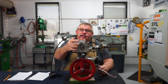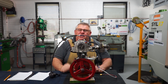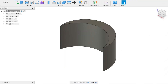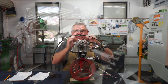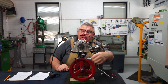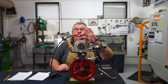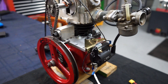The points lobe cam had me stumped. I considered welding the camshaft extension and grinding a lobe but decided that was too much effort. So I drew it in CAD and 3D printed a simple points cam lobe. I didn't want a cam lobe that snapped open instantaneously — I wanted it to gradually open the points. It took no time at all. I superglued it onto the camshaft extension and then bolted the coil onto the side, using the plate I'd already made that was holding the timing chain adjuster.